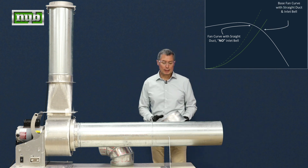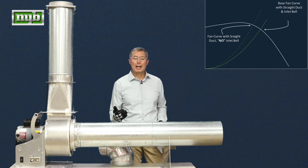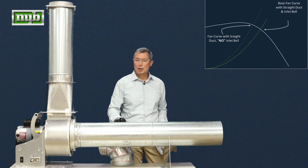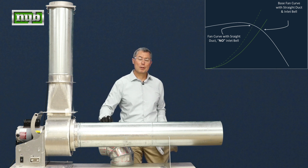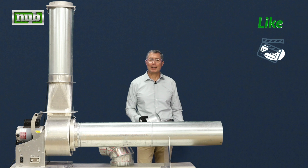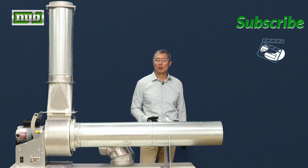As you can see, designing a good system — proper inlet conditions, no abrupt 90s, no abrupt transitions within that system — can help make the system more efficient. Couple that with moving the air into the fan uniformly, and you'll produce the most economical or efficient overall system possible. Any questions, put them in the comment section below. Any other videos you'd like to see us produce, put those in the section below as well. We'd like to make them. Thanks a lot.